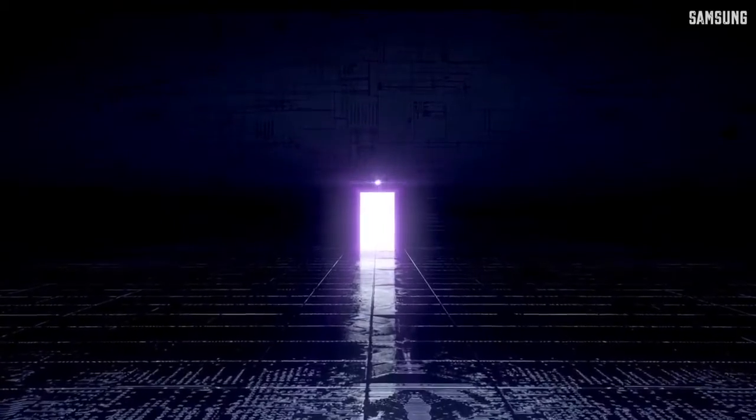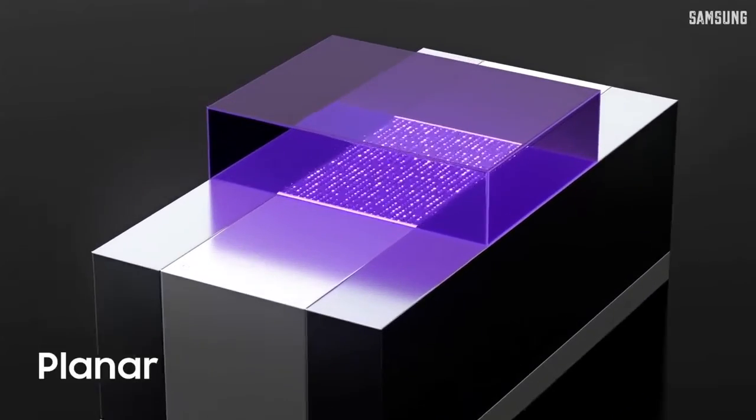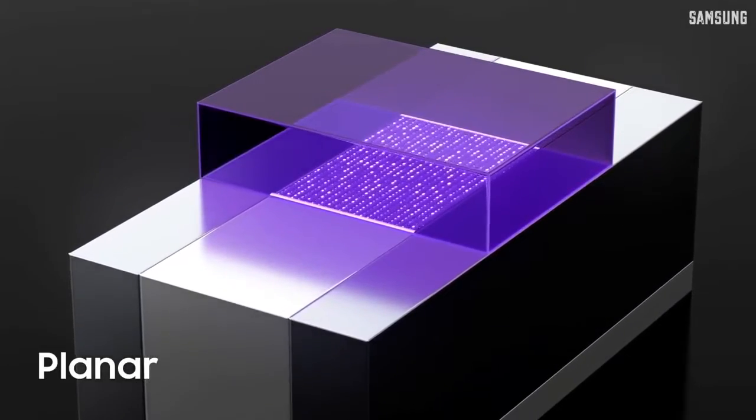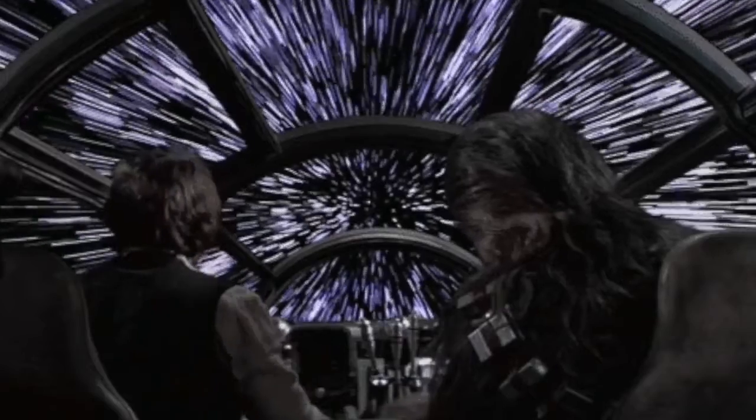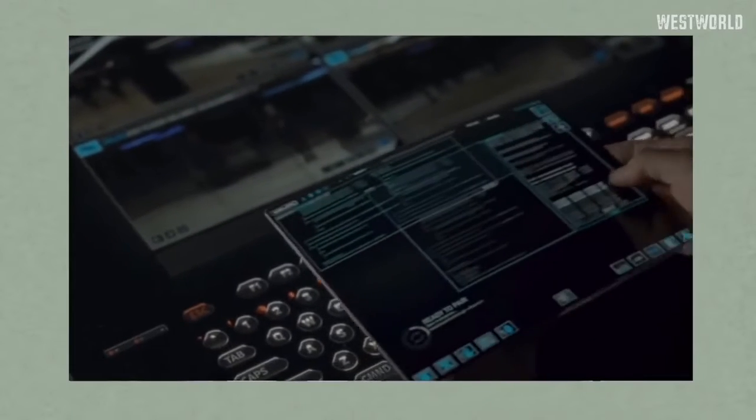Now, how does an organic transistor work? Actually, we can take any organic material and with a certain doping, right, we can make a field effect transistor. And it will be very similar to the usual silicon CMOS transistor, also in the way it operates. The big difference here is the speed. The speed of these organic transistors is orders of magnitude lower.